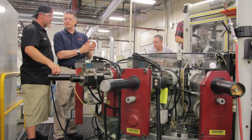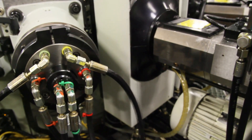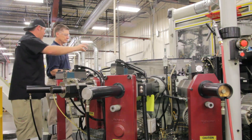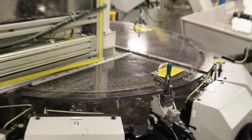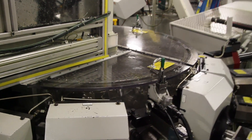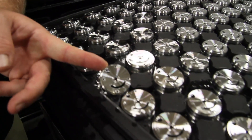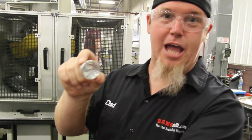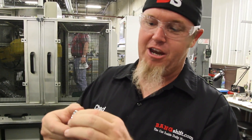First stations are cutoff stations, then we go into what we call a 16-station tombstone and rotate to each individual station. The collet that's holding the part does not move — that's the whole key to holding dimensional stability. Once you grip the part, you never let go of it until you're done. Everything that machine takes from that big pile of bar stock makes it so every single surface you can see is precision machined.